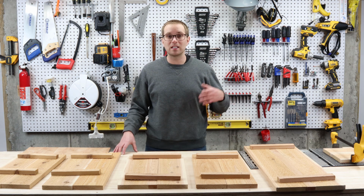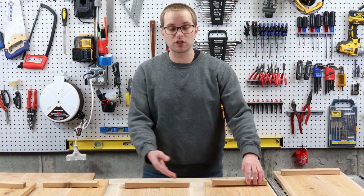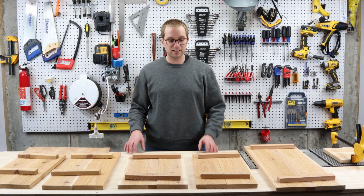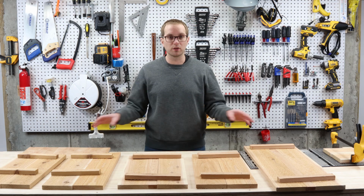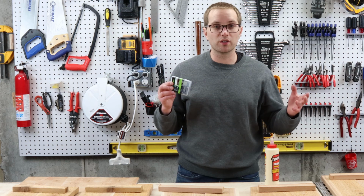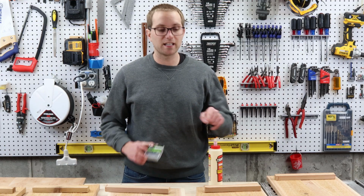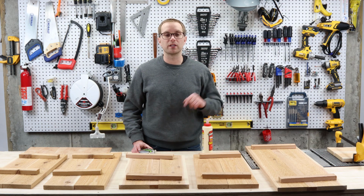It's also too loud to keep using my power tools here in my shop. That's why you saw me using my handsaw to finish some of these bracing pieces. Next, I'm gonna nail and glue my boards together. These are galvanized finishing nails. I've got about 150 of them. It should be just enough to finish the whole project. They're a little on the dainty side, but it's enough to hold the boards in place while the glue is setting.